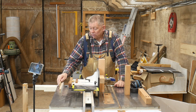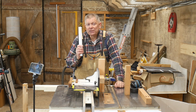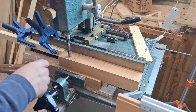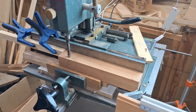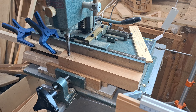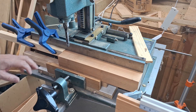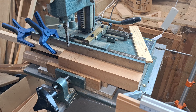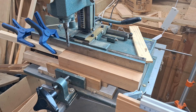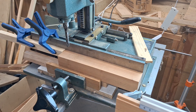To do this, we use a separate spacer — one for the tenons and one which is the distance from the centre of one tenon to the centre of the other. We start by cutting the mortises on the mortiser. I've got two mortises to cut and I'm starting by cutting the one closest to me, which is furthest away from the face of the workpiece. I've set up my mortiser for width and depth. There's a depth stop over here, and I'm going to go right the way through, so I've got a piece of scrap underneath to try and give me a clean exit wound. I've also got a positioning stop clamped here because I need to reposition this in a moment and it needs to go back in exactly the same place.